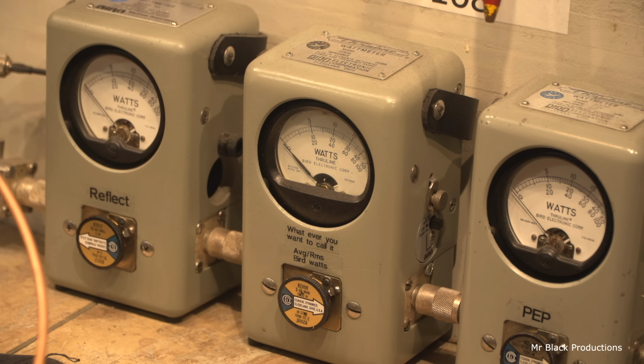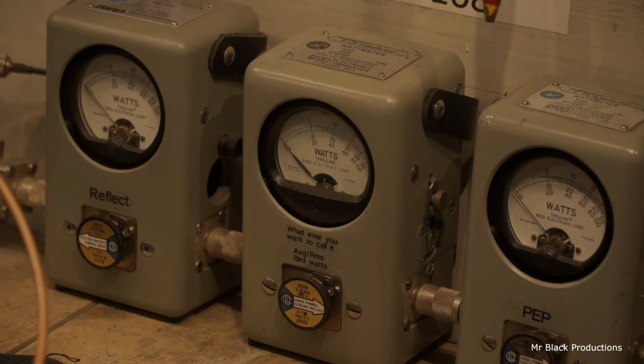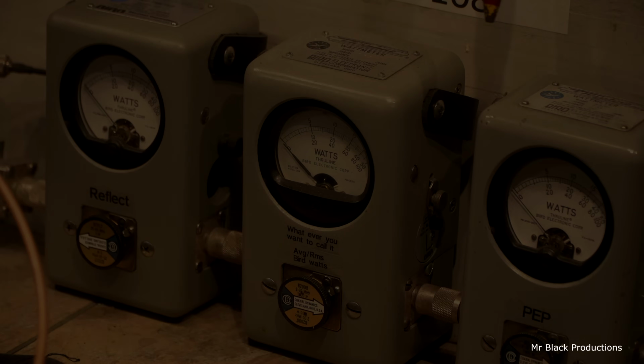Waiting on them supercapacitors to charge. There, we're at 14.5 now. About 20 watts. Amp on. 1 2 1 2. Now we're up to about 425 watts, which is about all this thing should do. It's got 4 60-watt transistors in it. Simple, easy peasy, right?